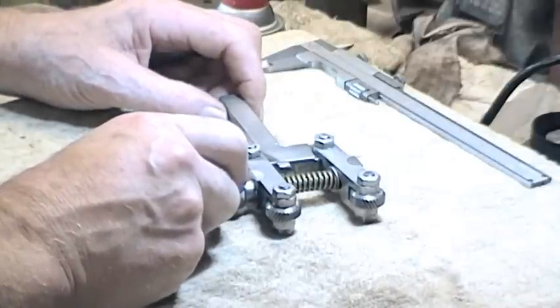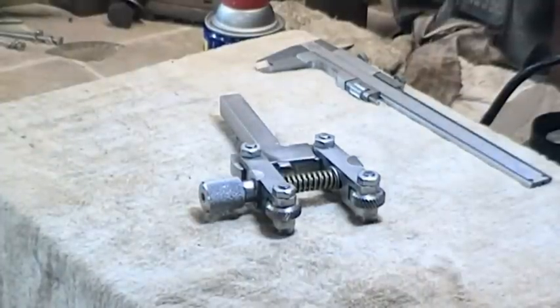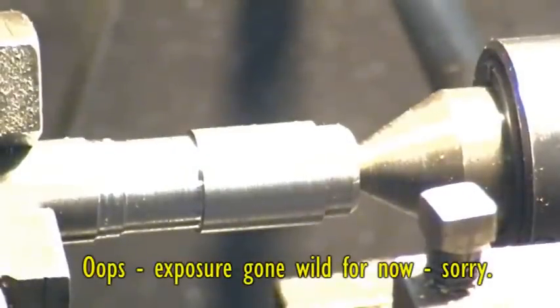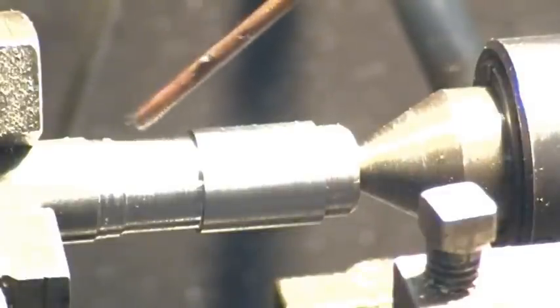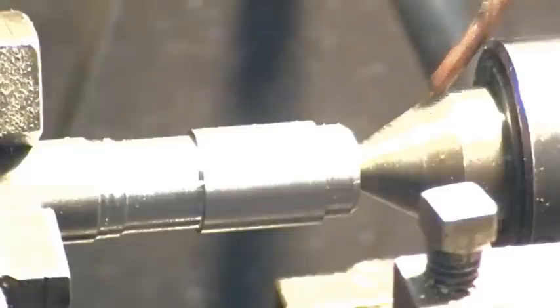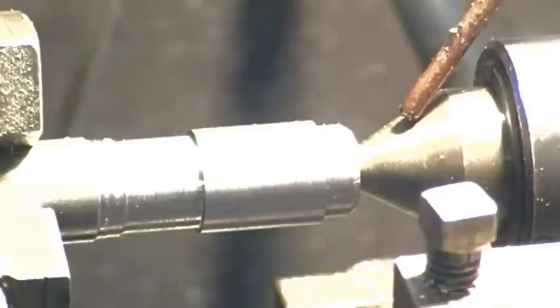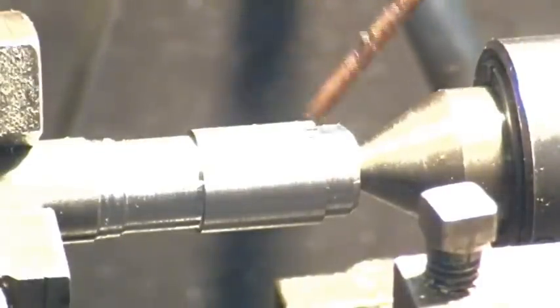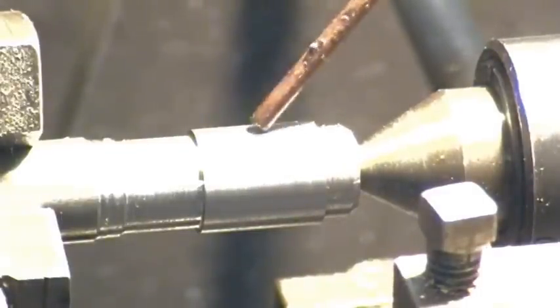I've got a piece of scrap prepared adequate to demonstrate this. We've prepared a piece of round bar out of my mild steel box of bits. It's been roughly turned just to a slight profile — slight relief here, slight relief there, a little bit of chamfer. We've got it on a live center, which is always desirable for knurling as it takes a bit of strain off. We're very close to the chuck; this area here is probably about 20 thou bigger, and that's the bit we're going to try and put a knurl on.